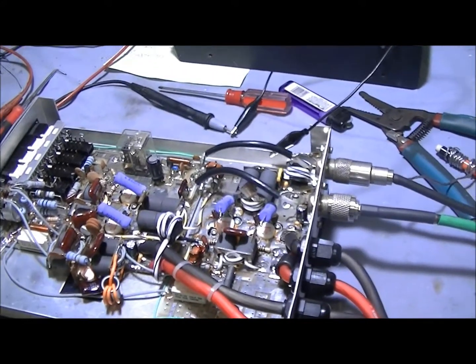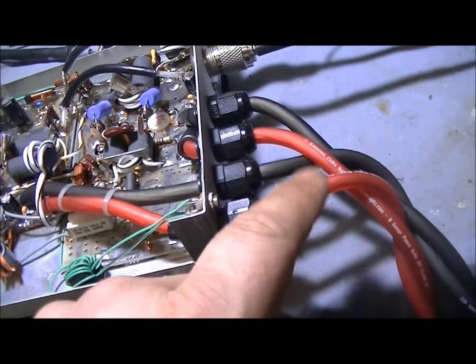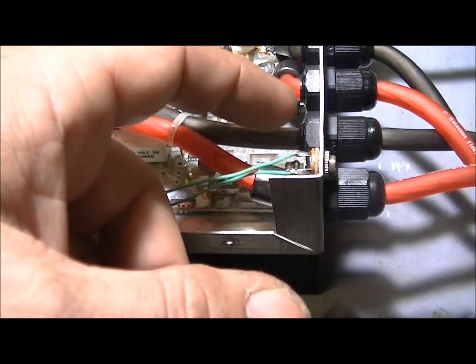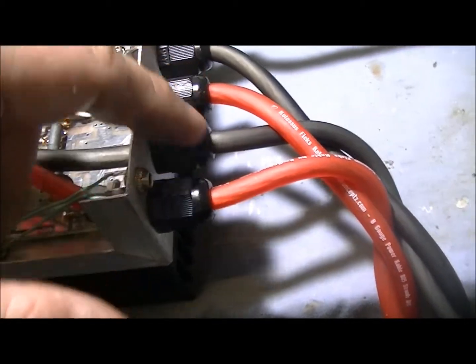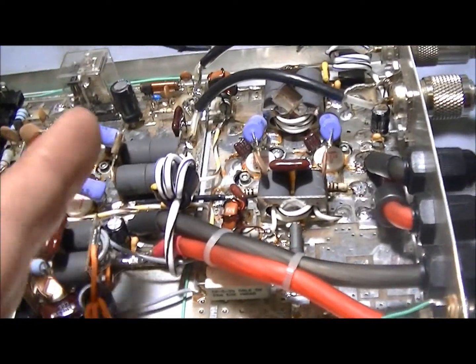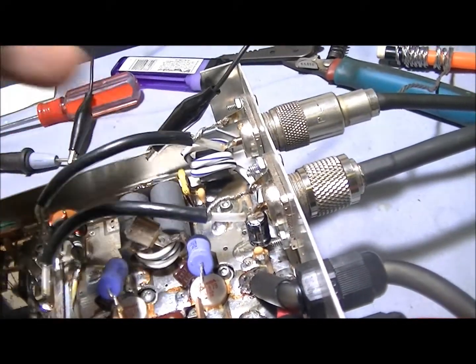The RMS ranks right in there too - about 300 on the Bird. I'm absolutely blown away. If I switch over to the 100-amp supply this thing will be doing a kilowatt. I've got the full power wire upgrade done. I usually put power-power, ground-ground, but I staggered it this way because the splitter is positioned a little differently on this one. You requested 10-gauge on the transformers - here you go, 10-gauge Teflon. That stuff is not the easiest to work with, and it's some big wire.